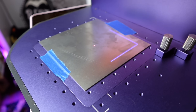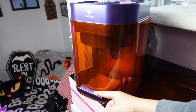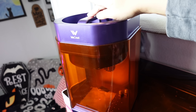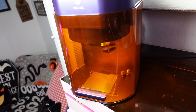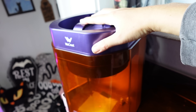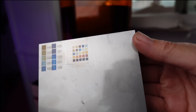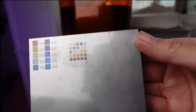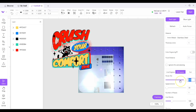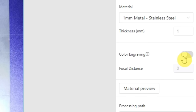Once you select a color, the machine moves itself up to that specific focal measurement — don't change it, don't touch it. It changes the focus points and wavelengths to make the colors, but the settings are sensitive to the exact thickness of your material. Don't try to refocus it; the red and blue dots will not be on top of each other anymore. Just leave them alone, set up the color array to the blue outline frame on your material, and send it to the laser.